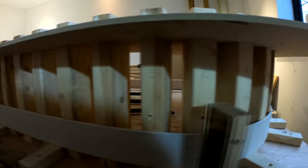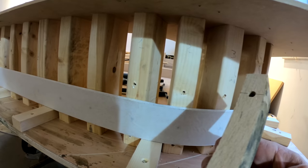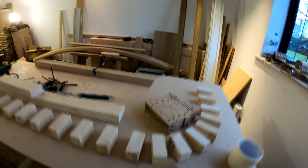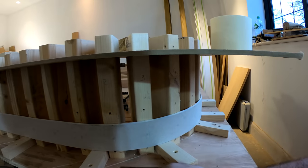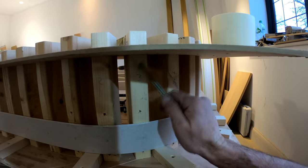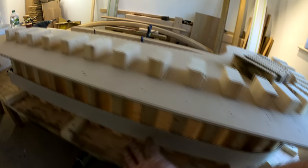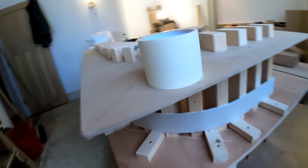Because G-clamps are so big here, we've designed this clamping system using a nice bit of off-cut oak — we've got seven of them, all numbered up. We've made sure the fittings go through the hole really easily, and we've piloted these holes so we get a good bite with the screw. If we hadn't piloted them, it would split the CLS — it's really important you pre-pilot because of the short length. We'll Cascamite each laminate and start clamping from this position, working steadily across. You'll see it on the time-lapse.